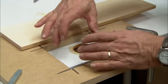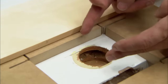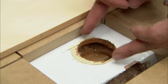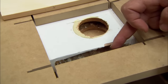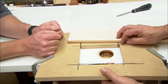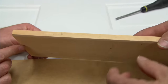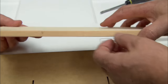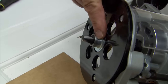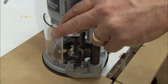Why is that? Because I need something to fasten the patch to. The width of the patch can be whatever I want, as long as it's wider than the diameter of the hole. In this particular case, I'm going to make the patch from this side of the hole all the way over past the edge of the door, because I want to patch this edge at the same time. I took a piece of standard pine and ripped it down to a little bit thicker than I want the patch to be. I'm going to set my router a little bit shallower than the thickness of the patch — a plunge router with a collar at the bottom that will ride along my template and an upcutting spiral bit.